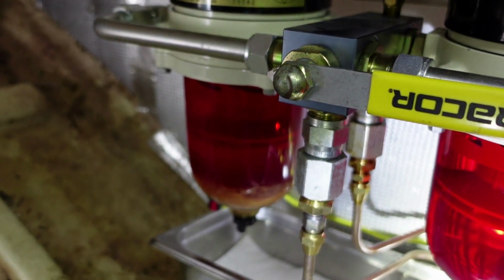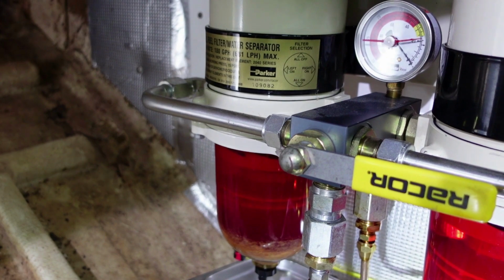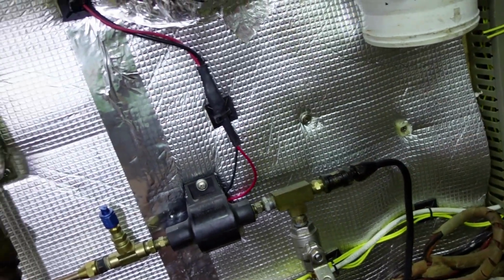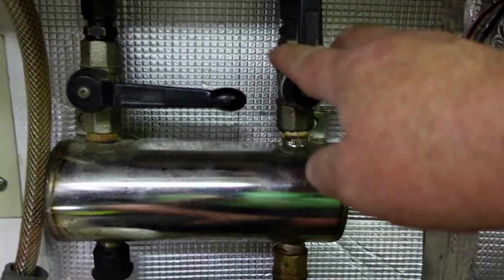So I was doing the polishing, sucking fuel out from the engine-driven pump into a larger pump out on the deck, and then I had it run into the deck fill, which is right back there in the back. I don't know if you can see it. So basically fuel came out here, went through that pump out there and to the engine-driven fuel pump, being sucked out with even more force through a larger pump, and then routed back into the deck fill.